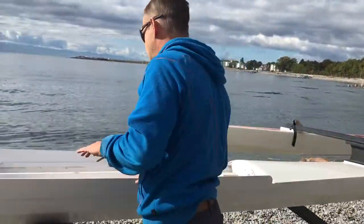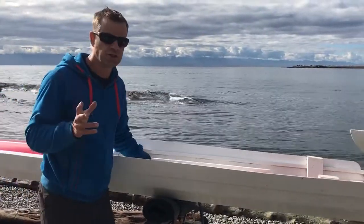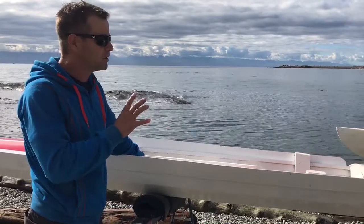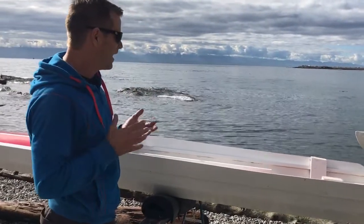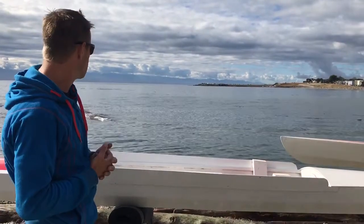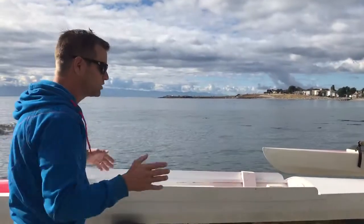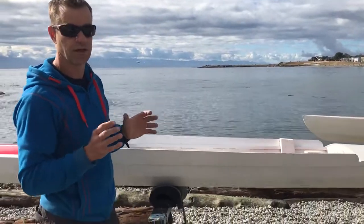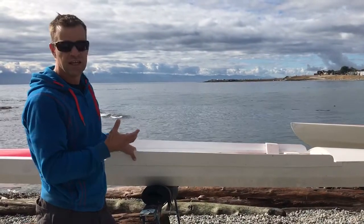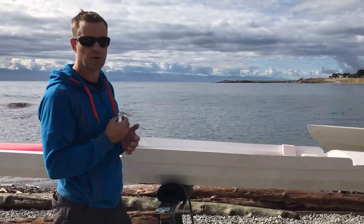This prototype we have here, since it's actually just one of our rowing shells, works out quite well. We're not testing any of the autonomous components yet — the navigation is still to be developed. Right now we just want to check out the overall way the hull and the appendages underwater react in different sea conditions. Today's a calm day because it's our first day out. Once we create the large deck, we want to put that on before we do the rough water trial so we get a full idea of how the overall configuration will react in big wind and waves. We'll be taking the prototype out in very rough sea conditions to make sure it's all balanced and performing as we want it to in rough weather.